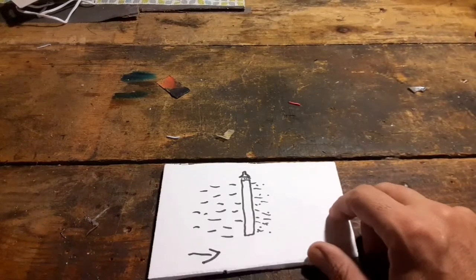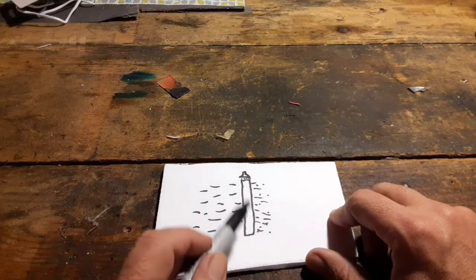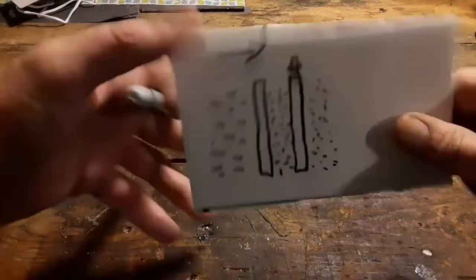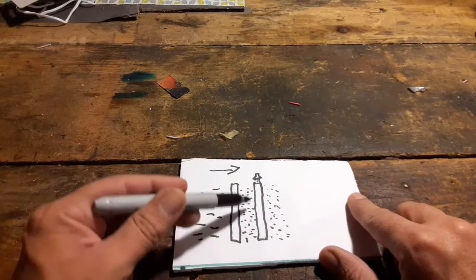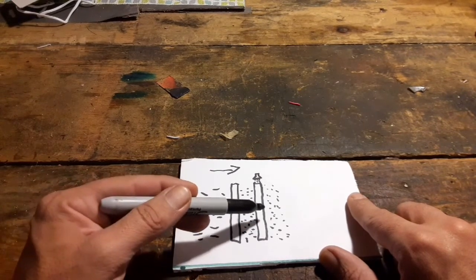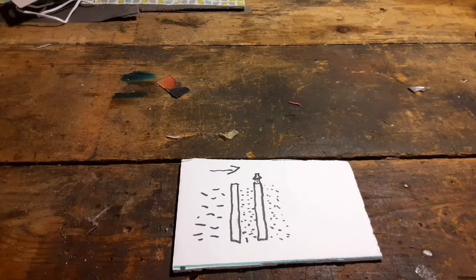Here's why I think that's happening: without the filter, you just have the wet mat and the metal grate, and air coming in isn't really slowing down enough through that mat, so it's not getting cooled as much as it could. With the filter in the way, the air is coming in but it's being more evenly distributed and moving a little slower by the time it hits that first filter. As it comes into the wet filter to cool the air, since it's moving slower it's cooling the air more and you're actually getting a little more efficiency out of the swamp cooler itself. That was an added bonus I really didn't expect, but I'll take it.